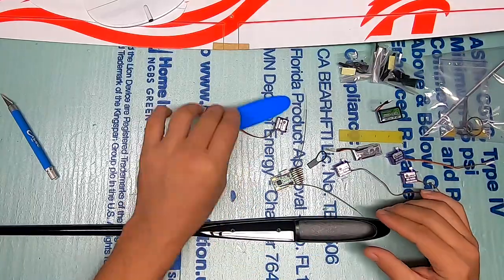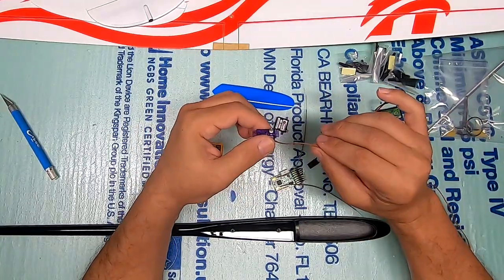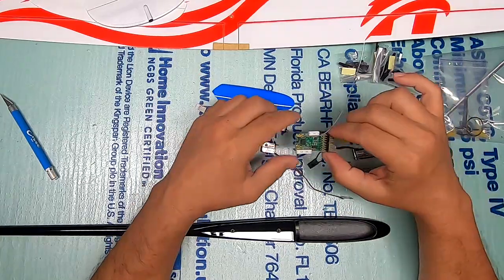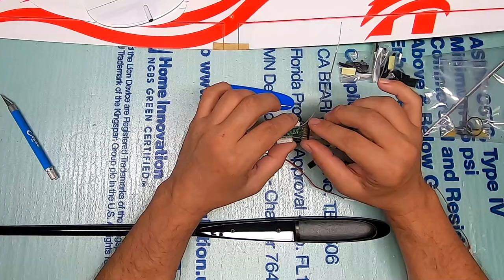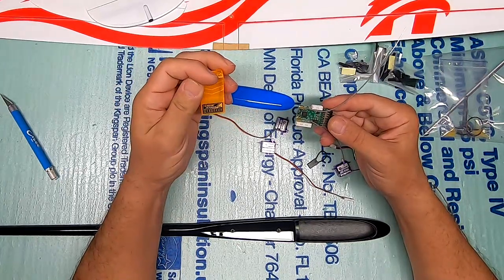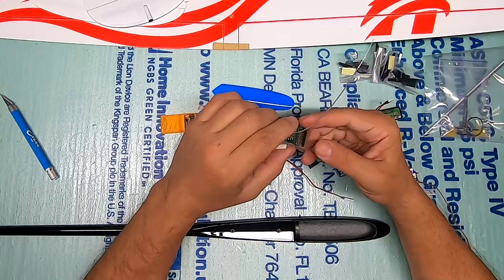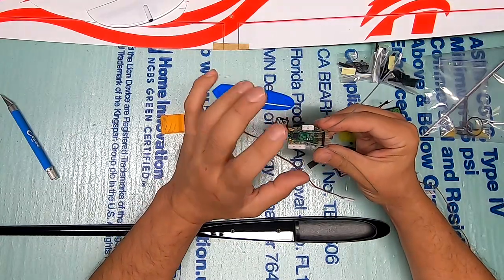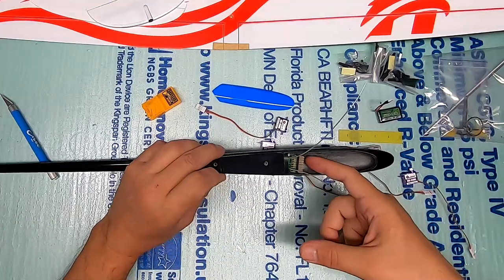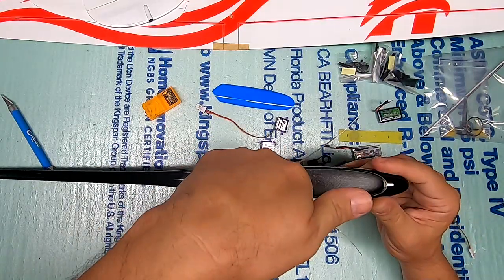I think I've figured out what I'm going to do with the layout. I talked in my intro video about trimming the wires and soldering them onto a receiver board. I have a receiver that has a bare board without the connectors, which would save space. This is an Orange receiver, specifically the R720X V2 — it's a six-channel, and with the plastic removed this receiver will slide all the way back into the fuselage.